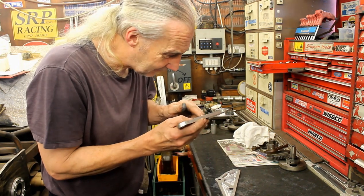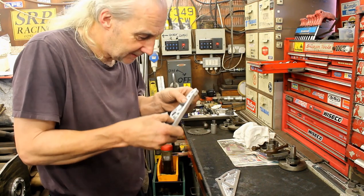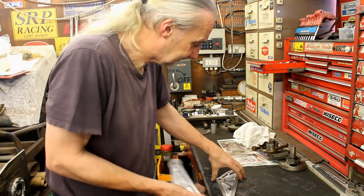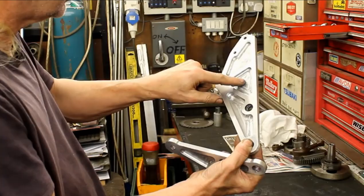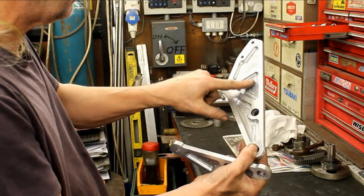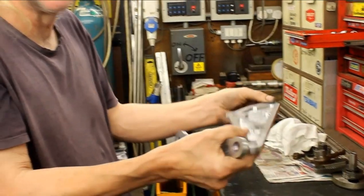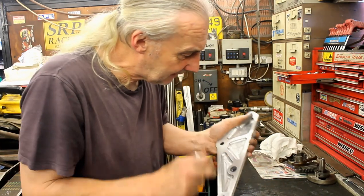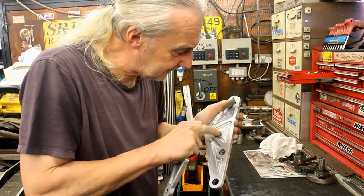If you look at the bottom, a CNC would leave it absolutely precise. But there is a few... Don't worry about it. If you turn it towards the camera, Jeff, so we can all see it, I will zoom in. It's flat, but there's a couple of thou here and there, because you have to move the table. I've had the quill up on the stop. I can always go over it by hand if need be. You could get a little thingy in there and smooth it off a bit. Yeah, I might do a bit of handwork on it before it goes off.